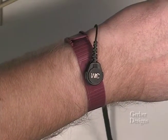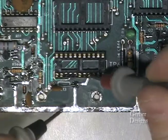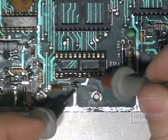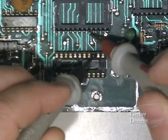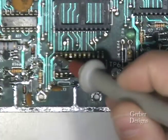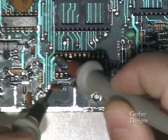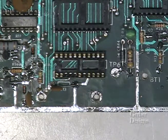This is the testing phase. First of all, make sure you are protected from ESD by wearing your wrist strap. Perform a continuity check on all of the connections on the U8 socket. This is very important as this is where most soldering errors occur. Using an ohmmeter, test from each connection to another location in the area close to the socket in which you can view a physical connection.